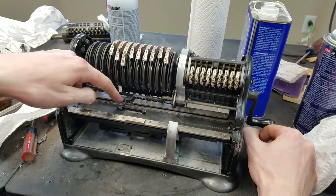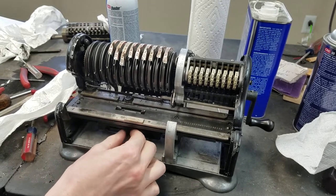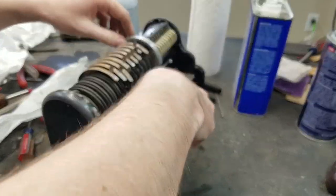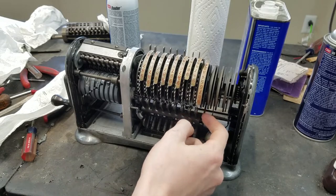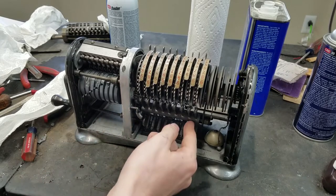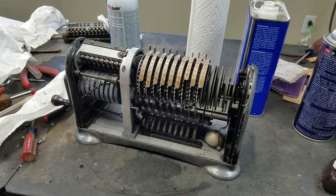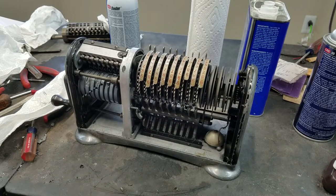You can see when I push that, these things go down, and that releases the carriage. These are like the ratchets on the bottom of the carriage. You can see this comes up to push the carriage one way, and that pushes it the other way. So that seems to be working. I'll show you the back side. It's really starting to get some weight now with all the parts going on. You can see this plate here has the springs for these. There's one spring that goes from this piece — which has the cam on it — over to this pin here. The cam follower goes on the front side of the drum. I think they changed this design somewhat in the later models, because the last Marchant calculator I worked on, this was not mounted to the carriage but was mounted to the bottom. I think that was an XLA, so that may have been why. Anyway, that's back in now.